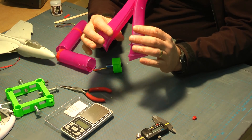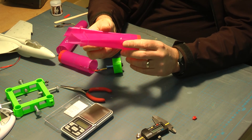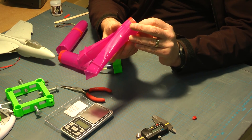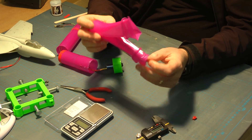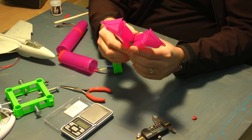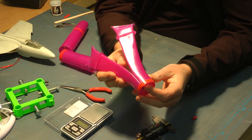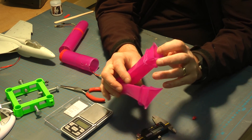The treatment I've used for all the pink ducting was basically after printing. I'm printing as thin as I can get away with — the wall thickness is currently about 0.35mm, so it's very, very light. What I'd do with this inlet piece is wet-sand it. I went through the grades on the inside — didn't bother with the outside. On the inside I went through all the different grades, up to about a thousand grit, and it is silky smooth.